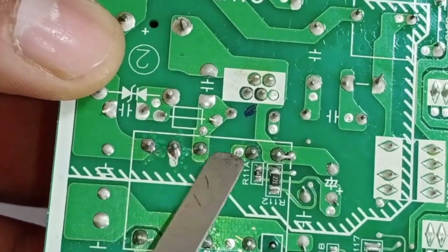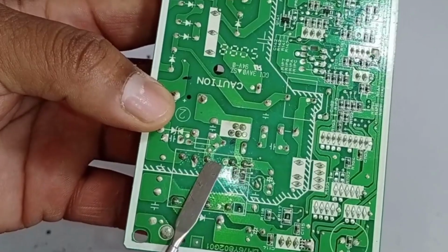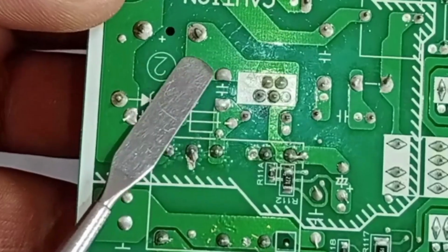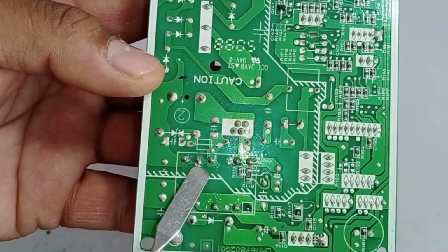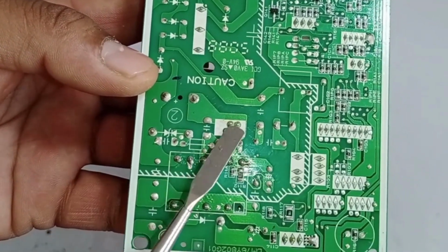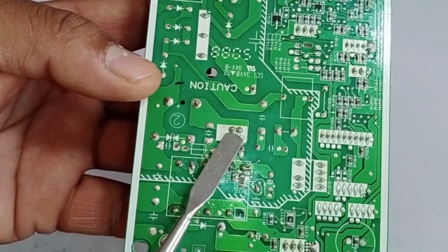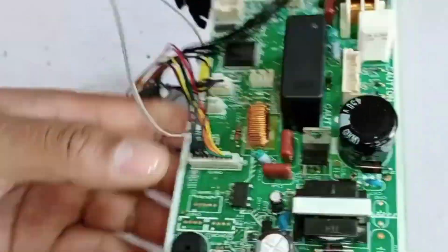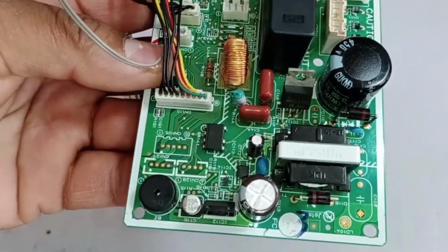So first, we need to check the drain and source to see if we are getting voltages. If the voltage is not coming at the drain, then you need to check the source. If the voltages are correct up to this point, it means the drain has not been switched on, which indicates that the switching IC has not turned it on. In this case, the issue could be that the switching IC itself is faulty. But despite this, there could still be some other faulty components.